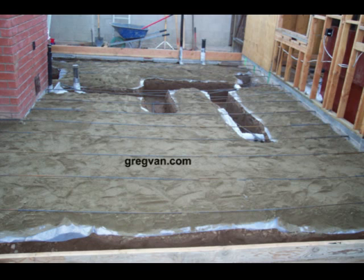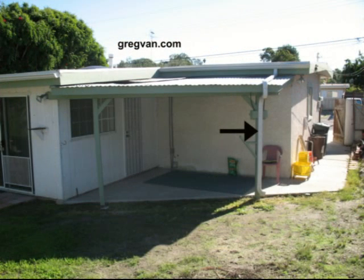What I did have as a comment for this guy is that the best thing you could do with either foundation — whether you pour a raised foundation or a concrete slab — would be to keep as much water away from the property as possible. You can do this by installing roof gutters and downspouts and try to get the water to drain at least five feet away from the building foundation if possible. The farther away, the better.